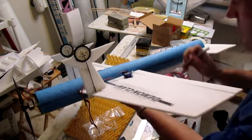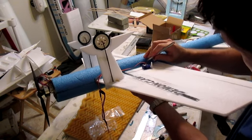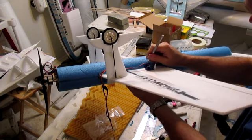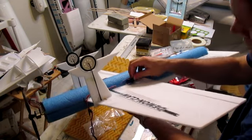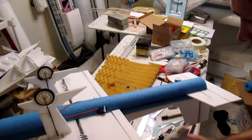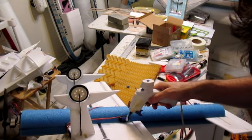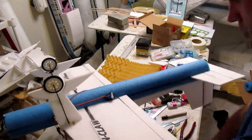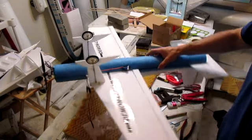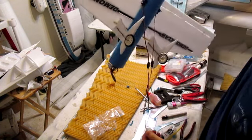Make the hole a little bit bigger. It's too small. There we go. We'll just pop that one in, just like that. Go ahead and take our hot glue gun and hot glue that right into place. Make sure you don't get any hot glue on the actual servo horn or the servo spinner. But see, look, watch. They move opposite each other, and that's exactly what I want. Oh, cool. And go ahead and disconnect the ailerons. There we are. They're disconnected.